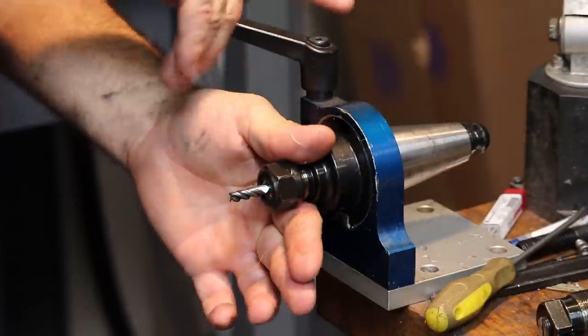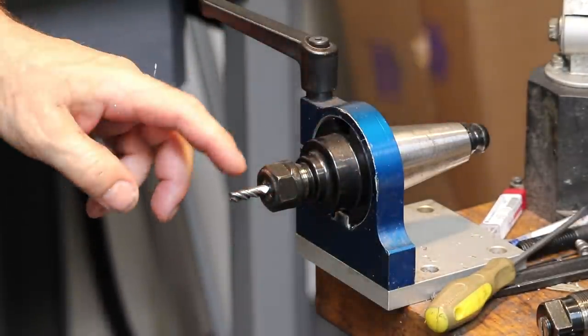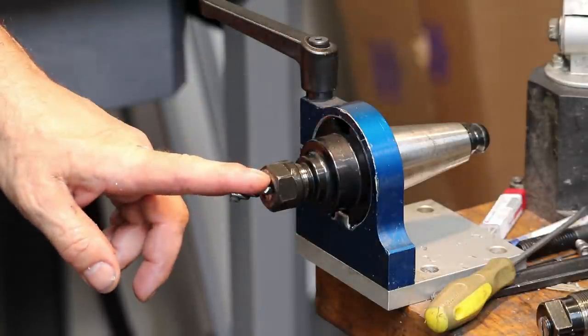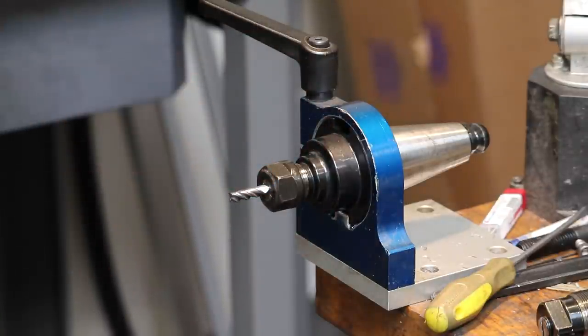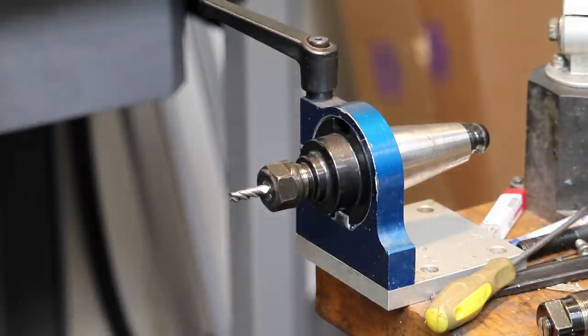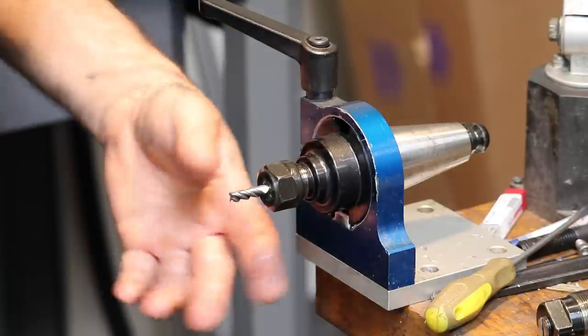And then here's the second tool. It's already loaded. I've already been using this 3-flute carbide 1/4 inch end mill. So the 1/4 inch is gonna do the roughing out of the outer perimeter of our mold insert. And then the 1/8 inch actually can do the rest of the detail inside. We don't need to get smaller end mills, which is fortunate.